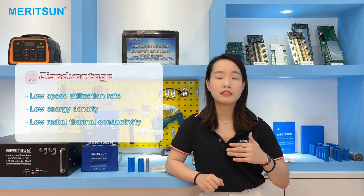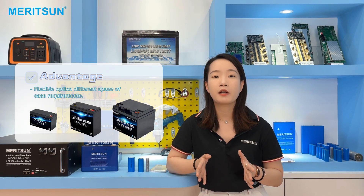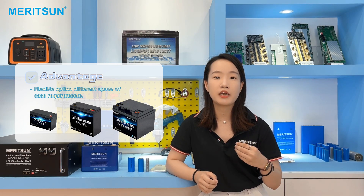The disadvantage of the cylindrical cell is that the radial thermal conductivity is poor, so the number of winding layers cannot be too many. That causes the single cell capacity to be small. Hundreds or thousands of cells are required to set up a large battery pack when using cylindrical cells, and high-level battery thermal management technology is also required. Due to the low space utilization rate and the relatively heavy steel shell, the energy density is not high for a battery pack assembled with cylindrical cells. However, for small battery packs like the 12V series below 100Ah capacity, the cylindrical cell can be an option because it's more flexible for configuration and accommodates different case shape requirements.